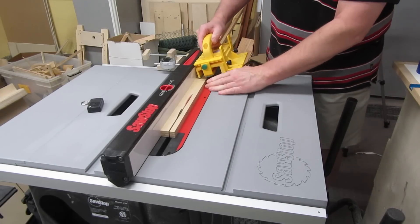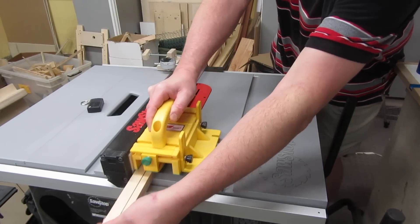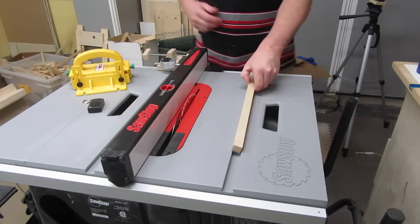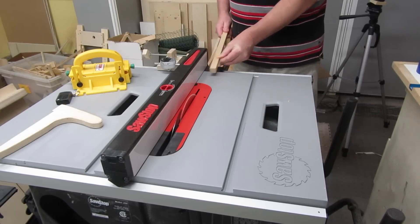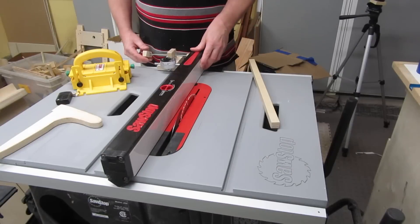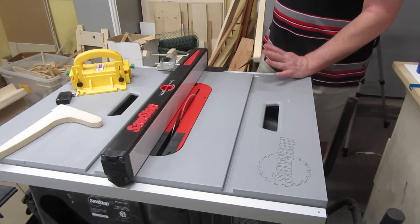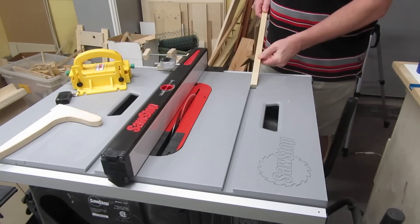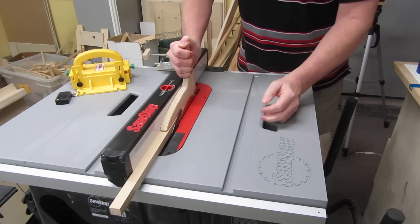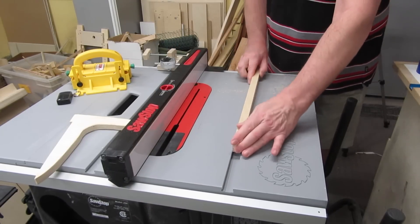If you don't know how to make runners, I have a video on the subject, but here's a quick overview. Cut some stock a little wider than your miter track. Move the fence in slightly, usually by tapping on the edge, although I have to use a jig for this. Trim a little of the end of your runner and see if it fits in your miter track. If it doesn't, tap the fence over a little more and try again — this is called sneaking up on a cut. If you make it too narrow, just turn the runner around and start again on the other end. Once it's the right width, cut the entire runner and make sure it fits. Sometimes you have to trim it one more time. For more details, see my video on the subject — the link's in the description below.